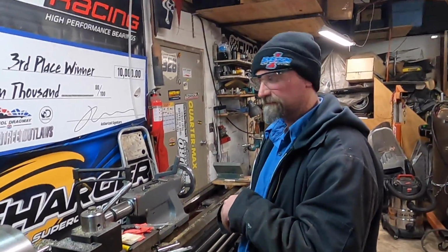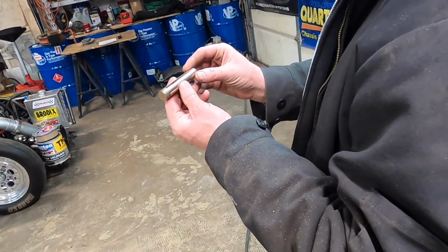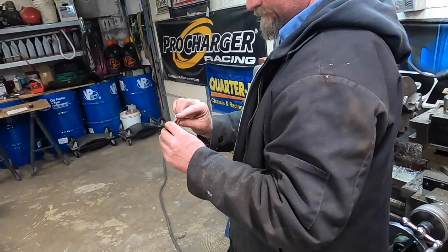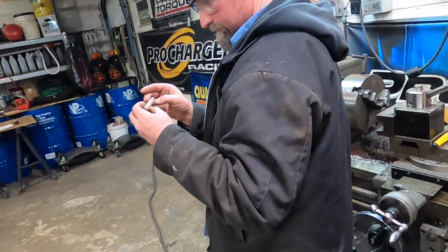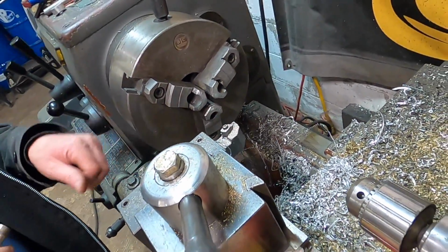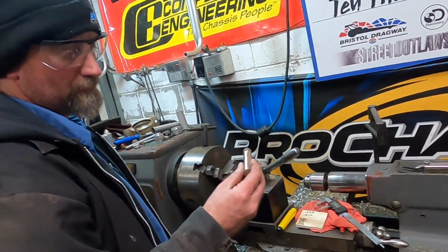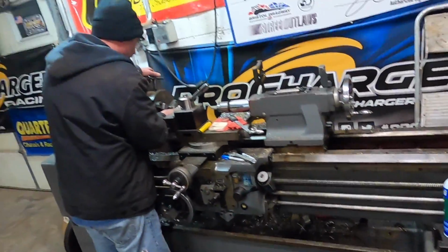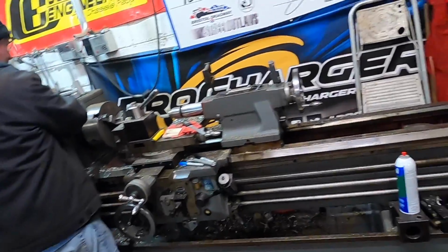Helps put a new edge on, flip your carbide around, get you a new edge. Wanting that real nice finish. And then he's just gonna polish it up. He wants that industrial look. I said, yeah, no problem. No problem, Bob. Now, I could probably use a smaller carbide and probably get the finish a lot better looking, but he's gonna polish it, so. Yeah, some real fine sandpaper or Scotch-Brite will knock that out. It's not like we're making automotive parts, he's making furniture, so. It'll do. Yeah.